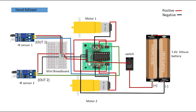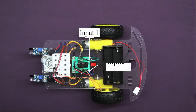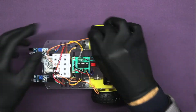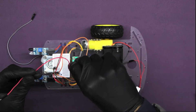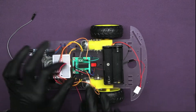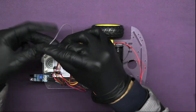In this case the sensor stops the motor when it senses any object in front of it. For changing the logic, we need to give a 5-volt supply to the first pin of input 1 as well as input 2. For powering the IR sensors, we take plus 5 volts and ground from the motor driver and divide the supply using the breadboard. The current goes from plus 5 volts to both sensors and inputs 1 and 2, and the same ground is provided to both sensors.